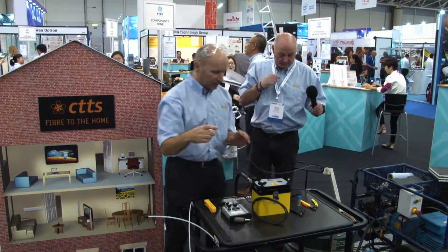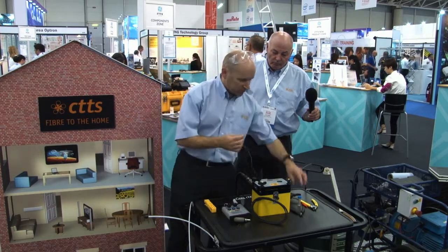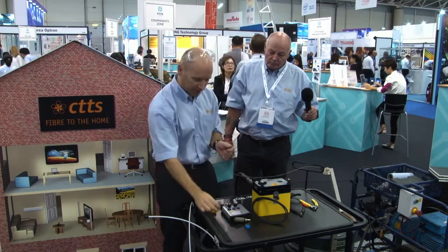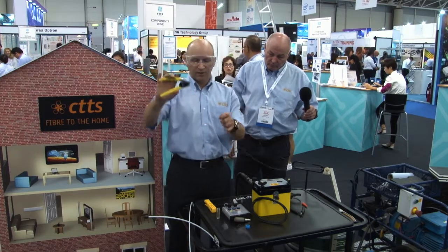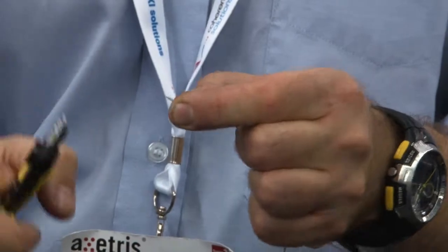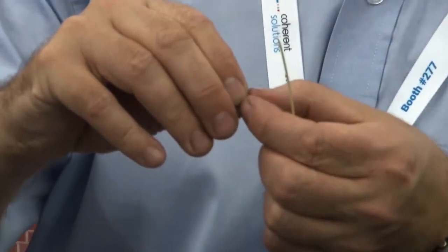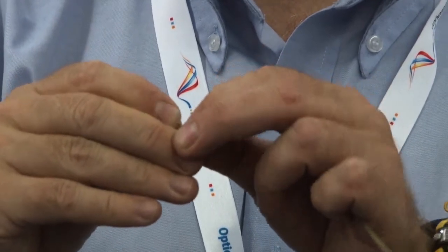through this guard, and then we'll feed it into the machine, so that the fibre has minimal drag as it goes through and hits all the edges of the tube system. I'm going to put a small blown bead on the end of the fibre. So I will strip the end of the fibre so that the resin coated fibre comes out of the end of the thermoplastic outer layer. I take a single blowing bead, place the blowing bead on the end of a fibre, and make sure that the plastic goes into the body of the bead.